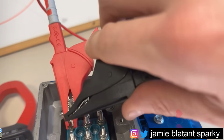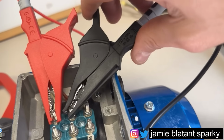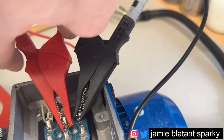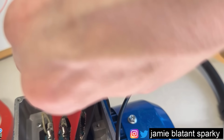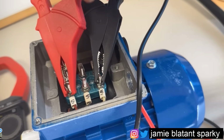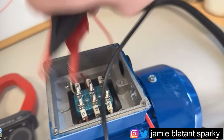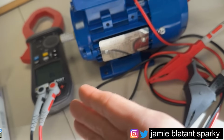We're not interconnected. So I go, the first two together, they're not connected. The end ones, they're not connected. And the last two, they're not connected. It takes seconds. I just do it on the other side as well. The two far ones, the two end ones, and the two next to each other. That's it. It just takes a few seconds to do it before you start measuring it, to prove there's a fault in there anyway that'll pick up on this test.